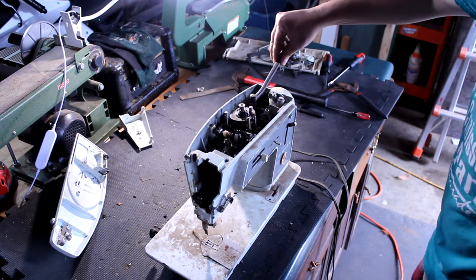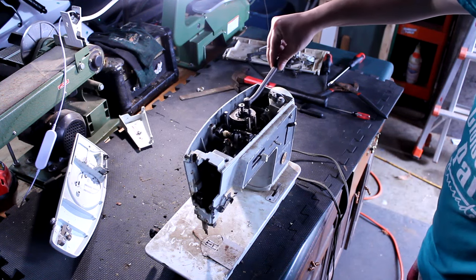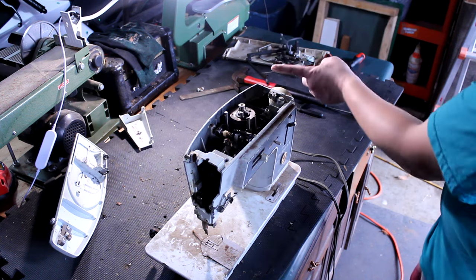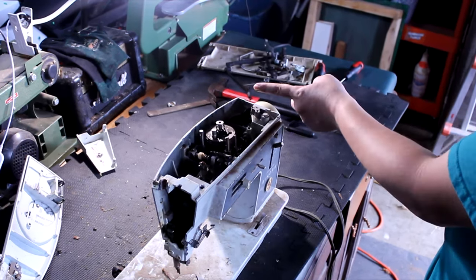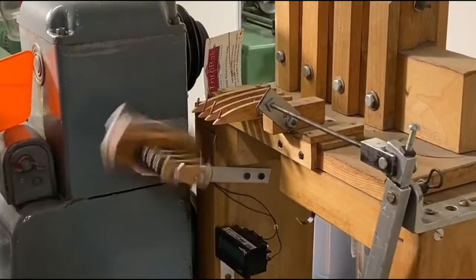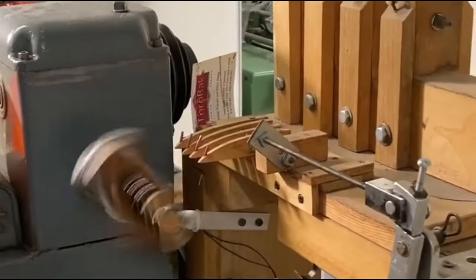Here's the idea I had for leaving that bobbin winder hooked up. You can see here that if I connect an arm to it, I can get it to act like a cam at a 5-to-1 ratio to create an automatic traverse attachment. I'll be able to stack about 4 bobbins on here and just walk away like the original Gibson auto winder that they used to do all those old PAFs.